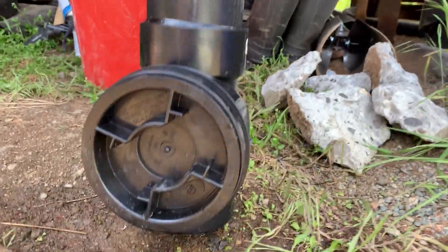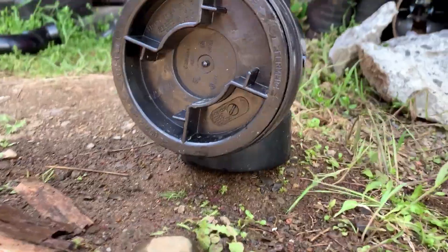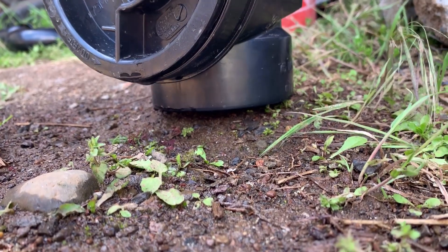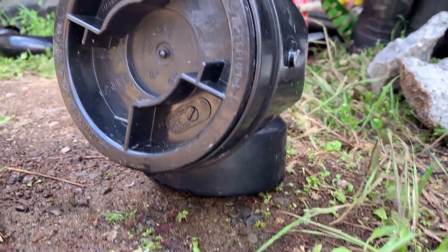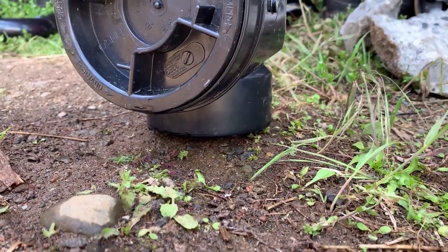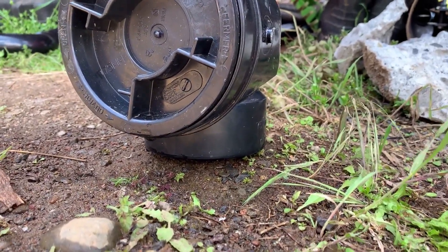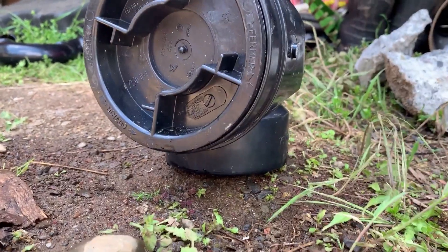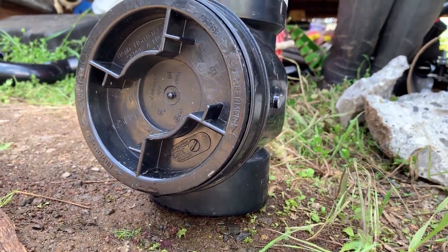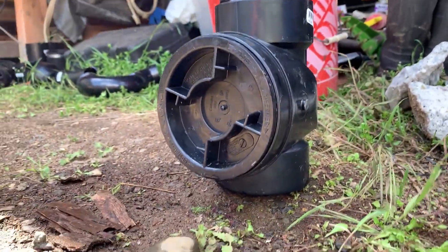Because this is serviceable — it's screw-tight and has a seal on it — it has a slow drip. It says hand-tighten only. I've finally got it to where it's losing basically only a drop. I've got a timer going for an hour to see how much water it loses. I don't think you can expect a check valve to block 100% of flow forever — it's really just for emergency situations where you lose power, your pump shuts off, and it buys you quite a bit of time to go close a valve and really shut off the flow of water.